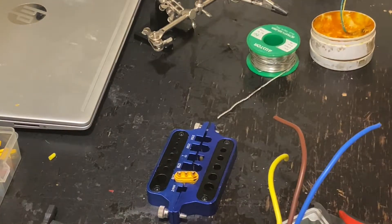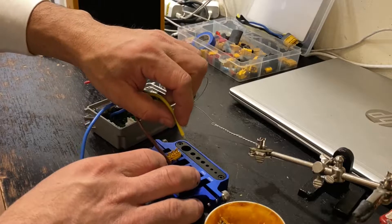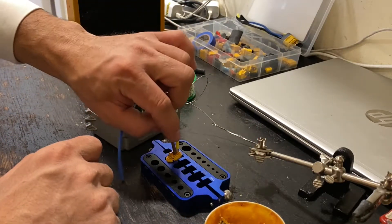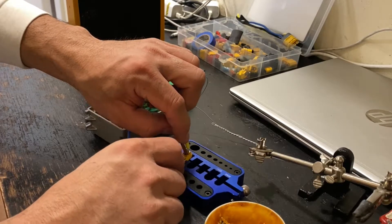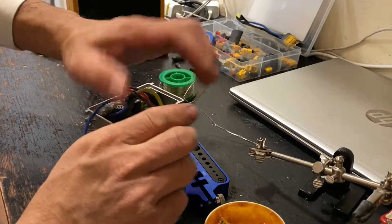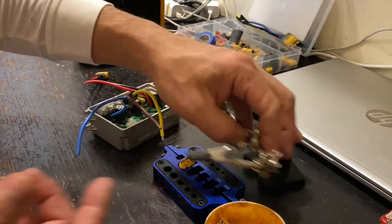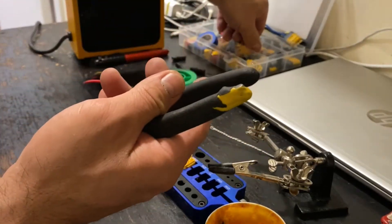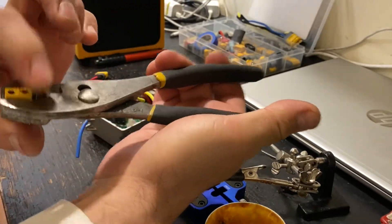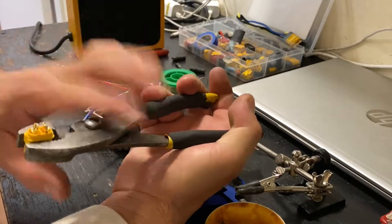It's very important that whenever you start soldering, you know where to start — solder there, follow with the next one. The iron is very hot, so if you start here and then go there, you're putting heat to the other pin, and even though it's minimal, it counts with this type of connection. When doing a connection like this, the first connection is always easy — just put it in and it stays. But when you put the second one, the connector might move. You want to make sure this part stays secure and doesn't move, even when using clamps — secure the connector so it doesn't move while you are making your connections.